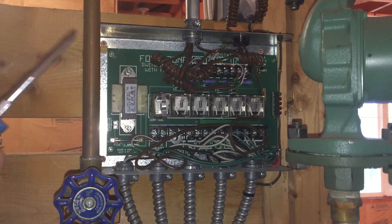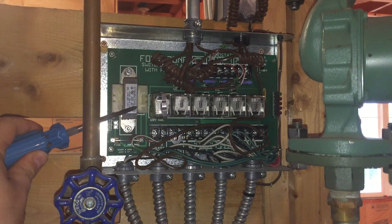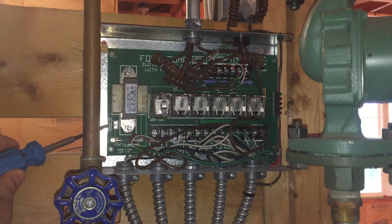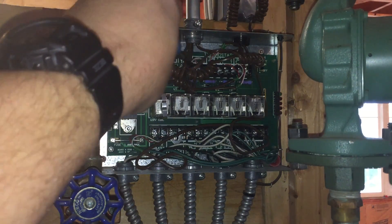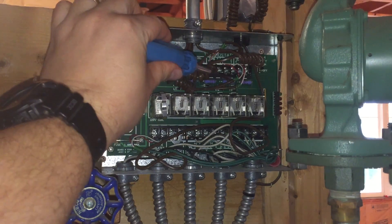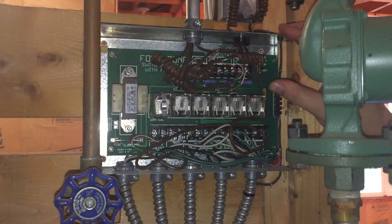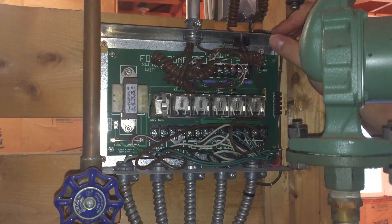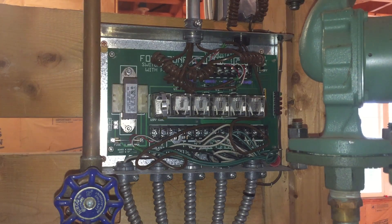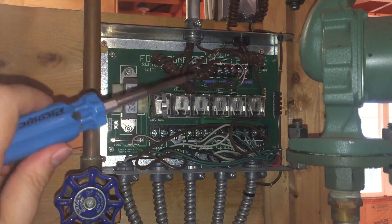Here's the inside of the controller box. It's kind of a reach because it's behind the boiler. Here's the transformer that generates the 24 volts AC. There's a two-terminal connector here with the output from the transformer — the bottom one is the common, which we'll need for the new wires we're adding. Here are the wires coming in from the thermostats, these brown wires. You can see the green lead is just wrapped around out of the way. There's a terminal strip for the four thermostat inputs. You can see the red is on the left and the white is on the right — and I believe that's backwards. I'm going to check it: measuring the red wire to the common should give me 24 volts AC, and the white should give me nothing. If it's reversed, it'll be the other way around.